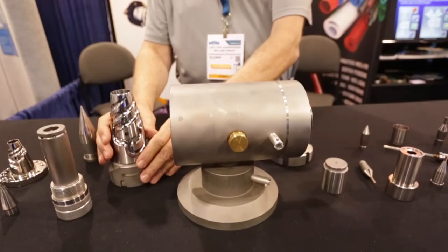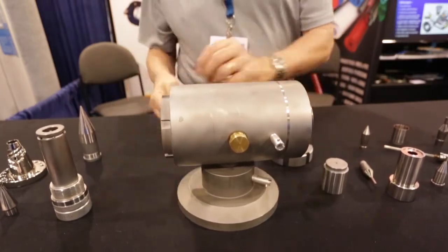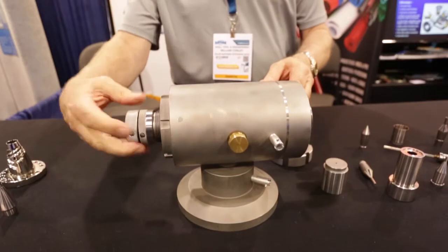You clean the body, clean the deflector, load a new deflector into place, lock it in, change the tip. The tip slides in — it's a fixed position tip. The tip retainer holds the tip in place.